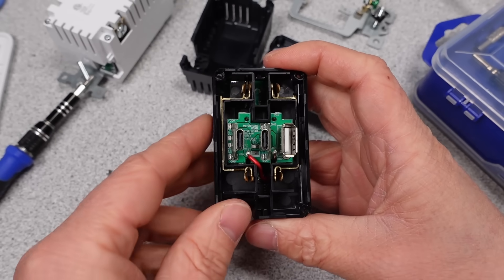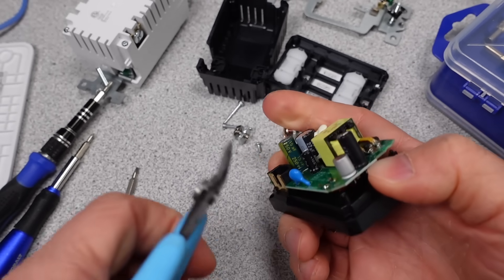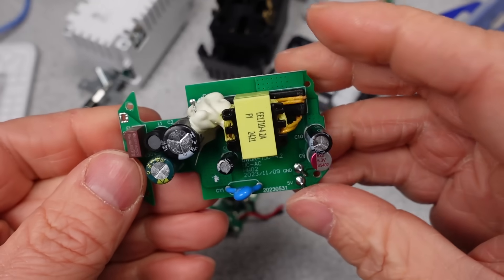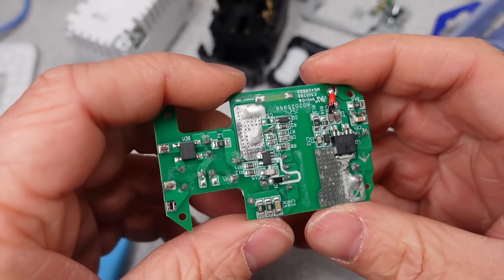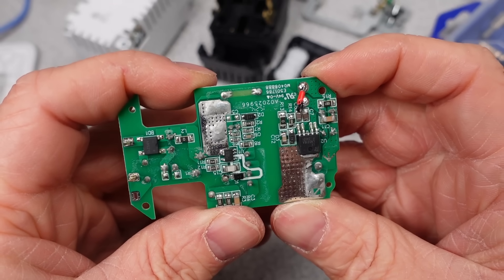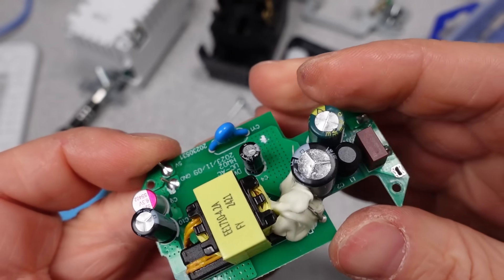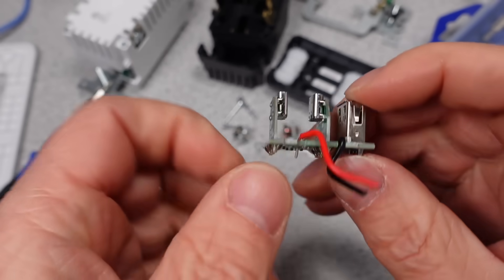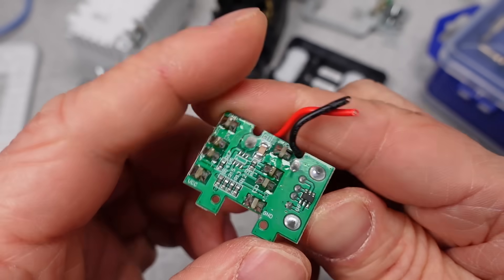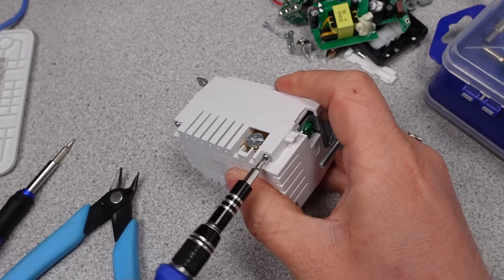The Top Greener is a 21-watt USB power adapter. It has star screws and honestly comes apart really easily — it's actually what I would call repairable. The components are pretty well spaced out and I don't see any issues with the construction. It notably doesn't have much for an input filter, which was seen in the data on the AC side being noisy. The output side is well isolated with double-insulated wires visible coming out of the transformer. The components all have appropriate ratings — it's a compact and simple design. The main issue is that the components look a bit small, which is probably why the efficiency is suffering. It's using resistors on the CC lines to provide 5-volt instruction to PD devices, but this isn't an actual protocol chip, so it is always on and can't cut the power off. It looks like there is no optocoupler, so this is relying on primary-side feedback only.